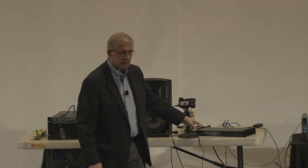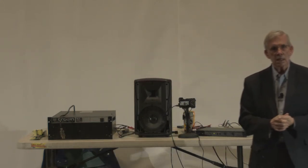Well, the control on the amplifier is intended to take your signal, whatever that is, and power the speakers with that. But if, say, you don't want to go as loud or you don't want to clip the amplifier, it's all done by turning this down at the front. Because you want your console, when a guy talks into it, if he talks really loud on peaks, you want it to go into the yellow, and you want it to be into the high greens when you're just speaking normally. Or what am I reading right now, Aaron, on your console? My console? Yeah.